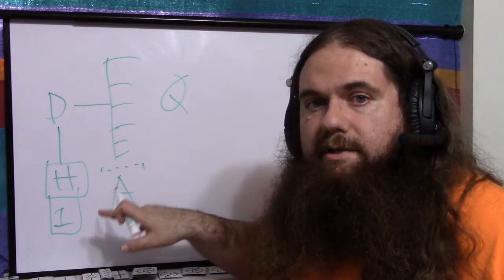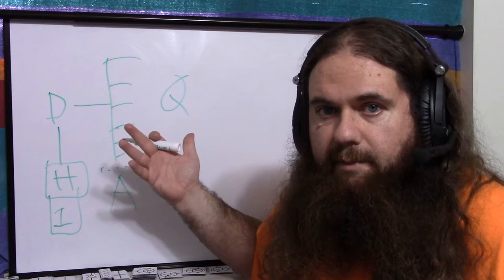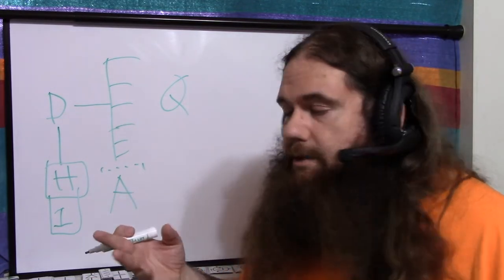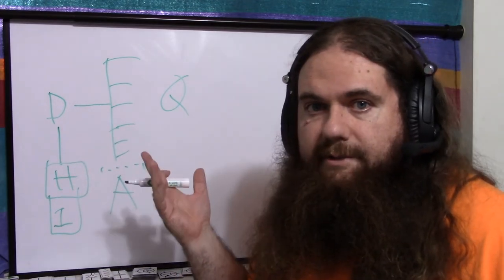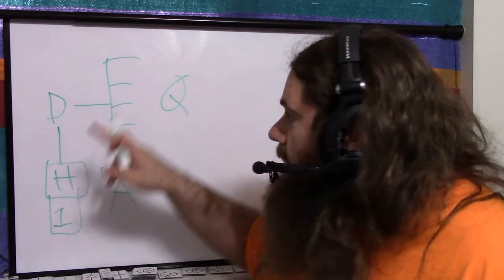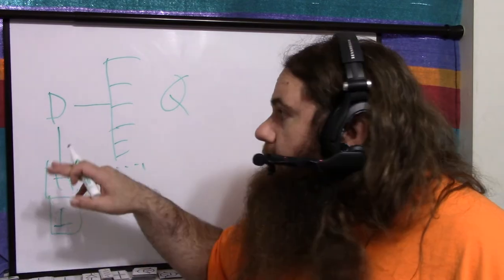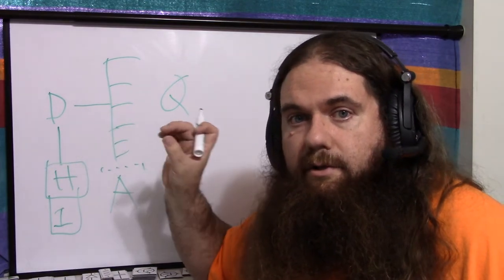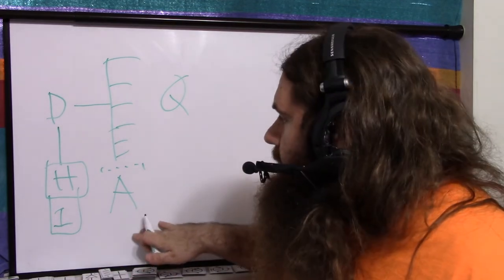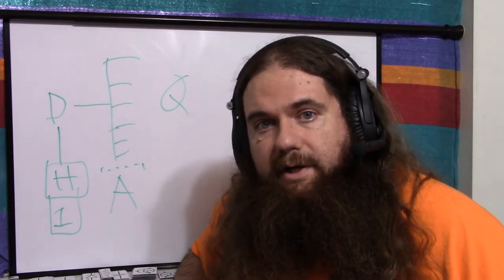So the address pins are not a selector for where the data are going, like in demux mode. The address pins are the binary number you are decoding, and data just becomes an enable. Speaking of that, you could set data to 0, and all the outputs would be 0, and in other words, you would disable everything. So you could think of data as your enable line for whatever these are connected to. So your binary number is decoded into an enable signal for other devices, but then you can just turn it off by changing data to low.